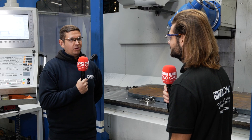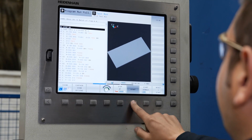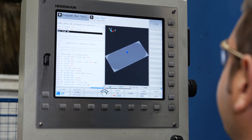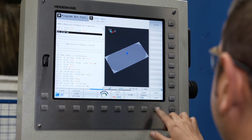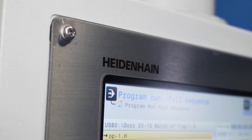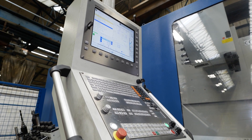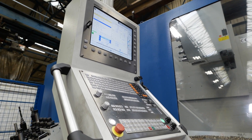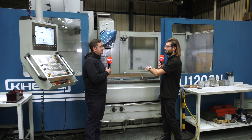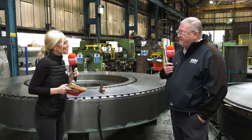How many tools are there in this machine? It holds 24 tools, including drills, thread mills, button cutters, and boring bars — basically everything you need to complete a job from start to end. And how easy is the control to use? It's very easy. You can program it point to point, you can use canned cycles, and if you have a rotary table it makes it very easy to rotate the planes — the control can already handle that.